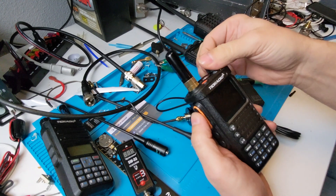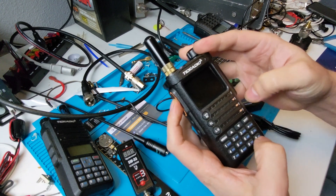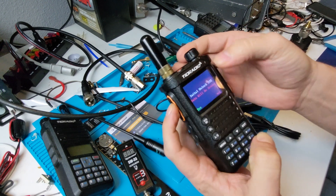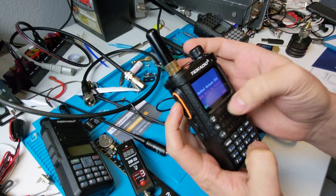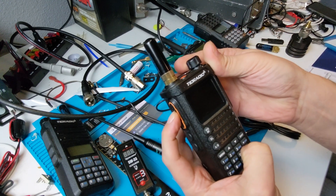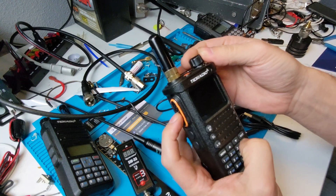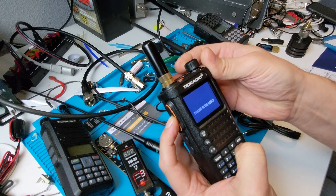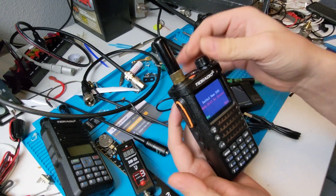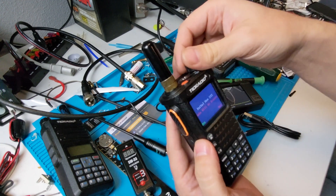Got two more things I wanted to show you guys. One was the Vulcan death grip, which I believe is PTT and one of these three lower right-hand buttons. So you press those two and you're powered on — you can unlock it or change that mode. The next one is zero and PTT turning on, and it's saying it'll set up for GMRS. And then lastly, I think it's the asterisk scan button, and there we can set it up as a ham radio. That should TX-inhibit on things you're not supposed to be messing around with as a ham.